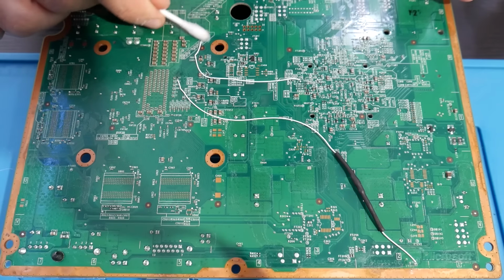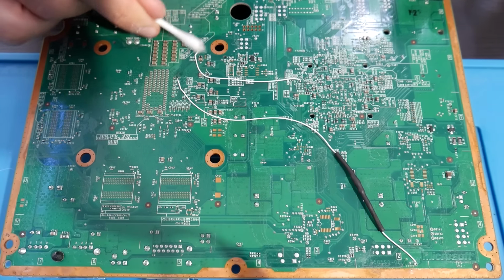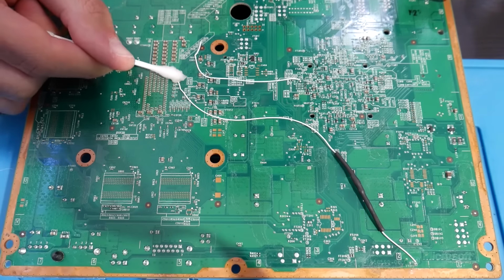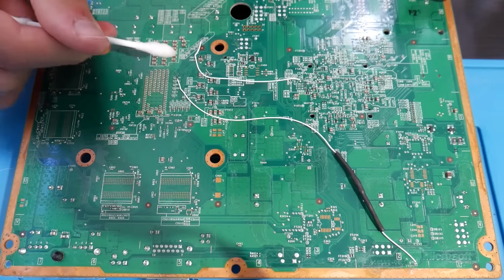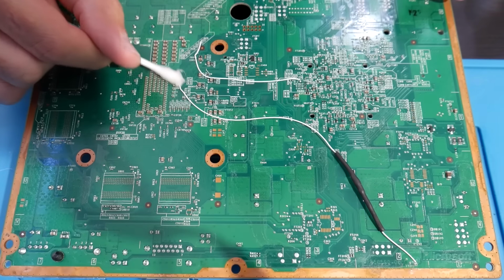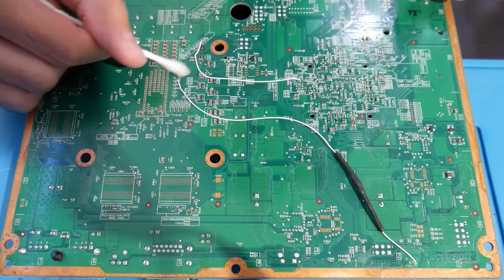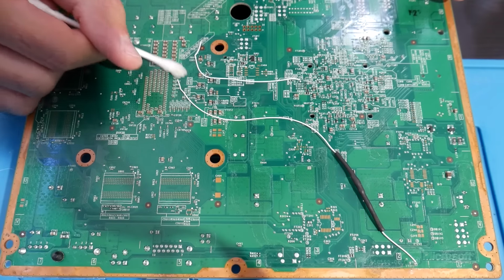Now here we go. Our console should look a little something like this. Just make sure your wires are set up in the same orientation here and they are connected to the same points accordingly. The nice thing when it comes to RGH3 is that wire placement really doesn't matter on here, but the quality of our points with soldering here is what's going to matter.